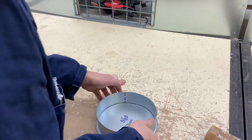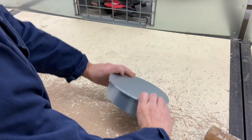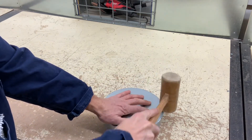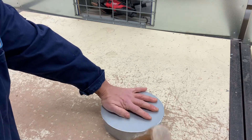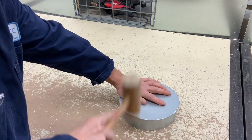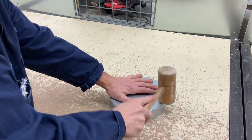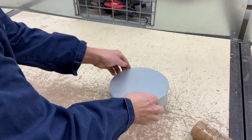This is to simplify setting it inside the cap. Once I'm confident that the fit is going to be okay, I will be flipping the disc upside down and using a mallet. I will tap on the cap and at the same time it is bending the flange 90 degrees on the body. The goal is to have the flange of the body push against the side wall of the 3/16 flange.